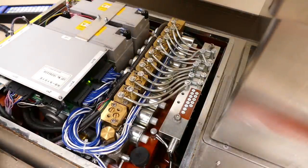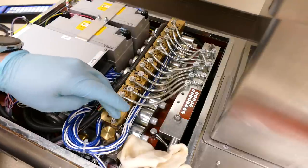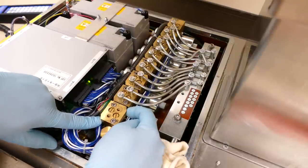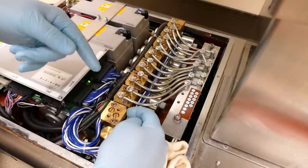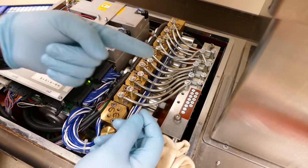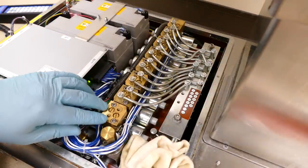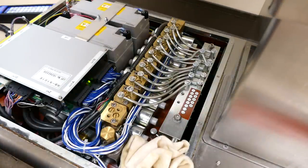Now for the layout on these blocks: these flat heads are poppet valves — you have over-pressure valves which are poppets — and you have needle valves which are on the diagonals. These needle valves control the speed of the axis: tightening them slows it down, loosening them makes it go faster by allowing more hydraulic fluid through. Then you've got two other check valves which are these tiny flat heads. The first thing we need to do is remove this bolt and this bolt right here — this guy is a 5/32nds.